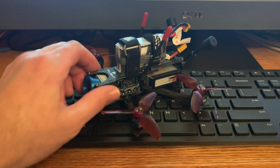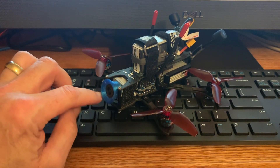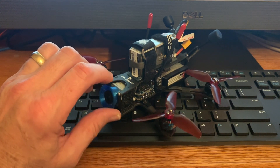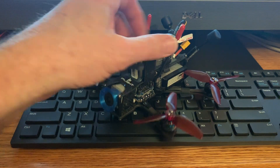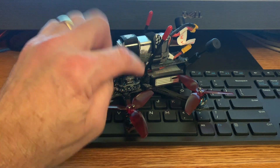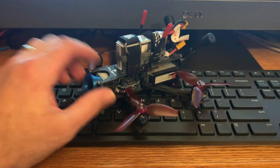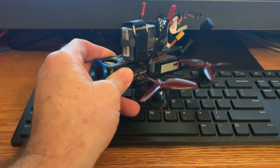The cons: it's not the fastest quad on the block, but that's expected because it's a cine drone. The camera protection is not good — I'd recommend buying an aftermarket cover for your air unit camera or printing one from Thingiverse; I'll link the one I printed. The antenna tube placement is not the best as it interferes with laying the battery flat, and the antenna tubes are short — I'm probably going to move the receiver antennas down onto the arms. It also did not come with landing pads, so I had to add those. Those are only minor niggles, but I do think this is a good cine drone.